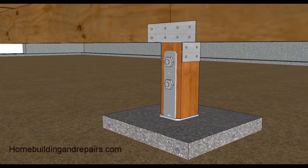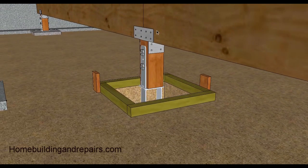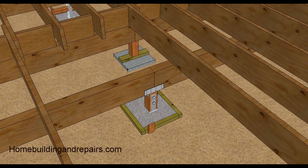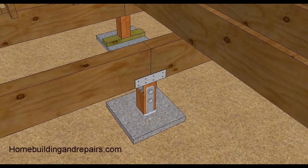Let's take a look at one of the ways you can assemble this. You can always assemble it this way: dig your hole, put everything together, pour your concrete, put a form around it with one, two, three, or four stakes. You pour the concrete, strip the forms, and there you have it.